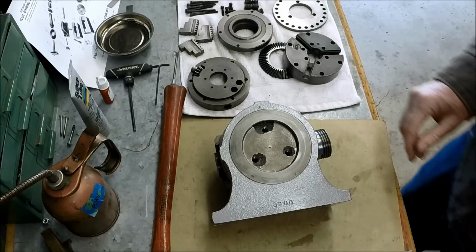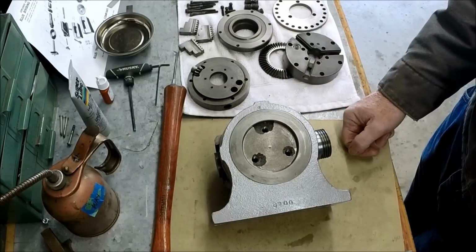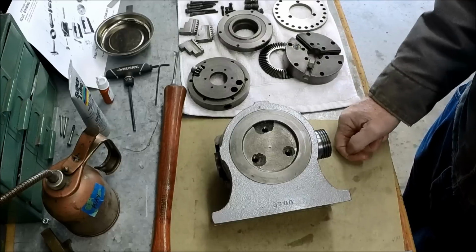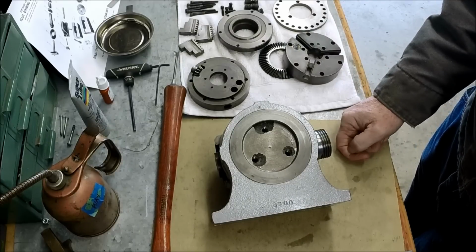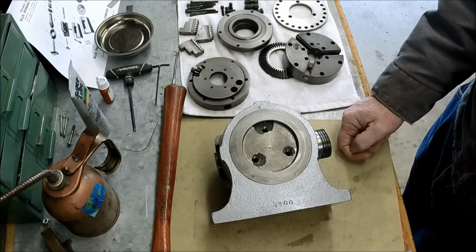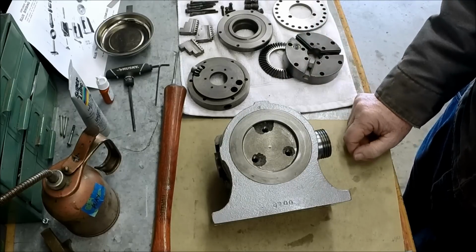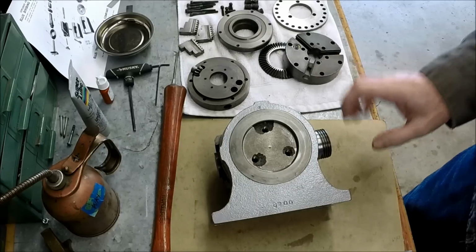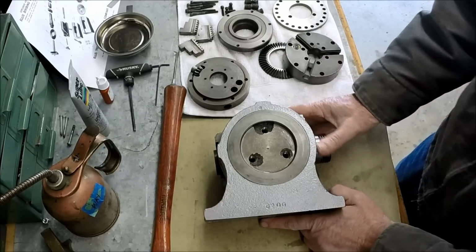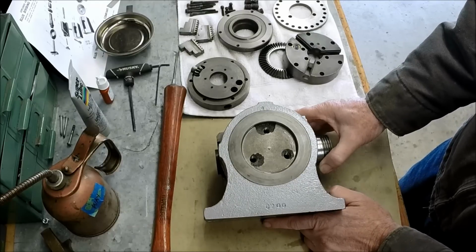So before I cleaned everything up, I looked at this, and there were these threaded holes. They were drilled pretty deep, but they weren't threaded all the way. So I came in with first a regular plug tap, tapped all the way to the bottom, then I came in with a bottoming tap and cleaned them up. So I'll get a close up, but we've got at least two, maybe 2.5 diameters of good thread still